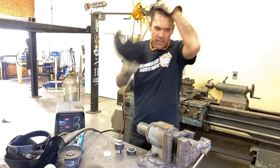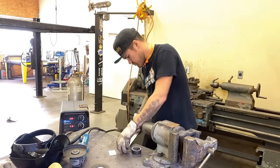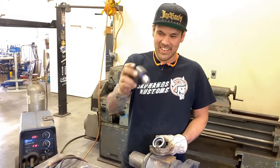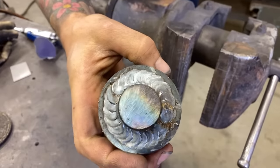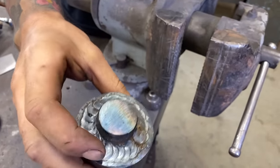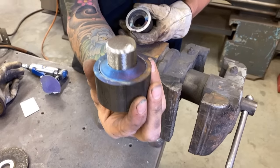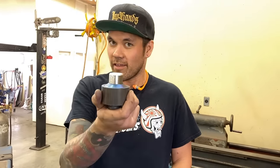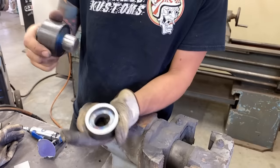The die is super hot so I cooled it off quickly. Here's the result: a big fat weld across the top is where we'll hit with a hammer or press, locking all three layers together. This is our dimple on the underside — it honestly looks very similar to the manufactured hammer-type dimple dies you'd buy.